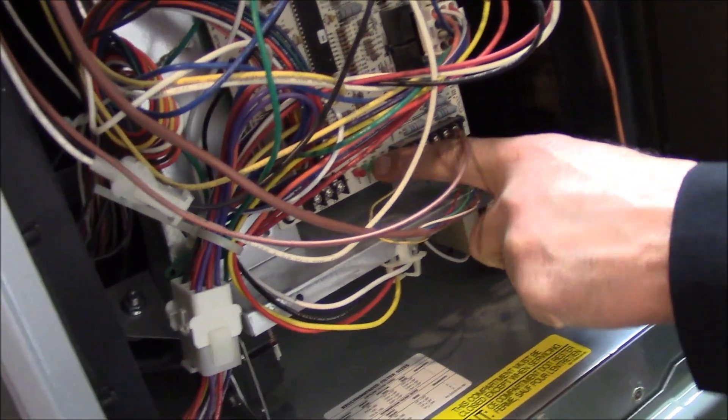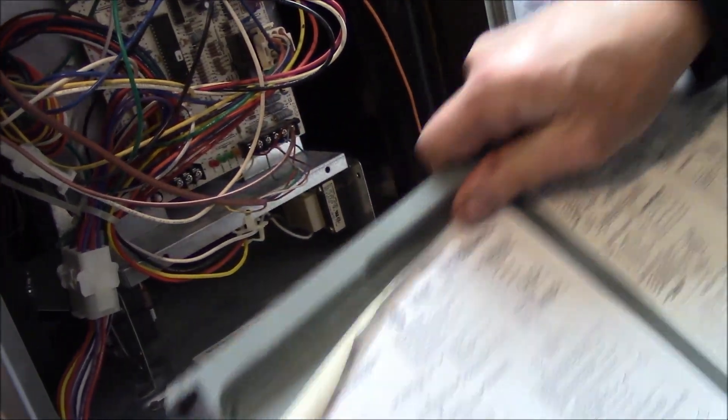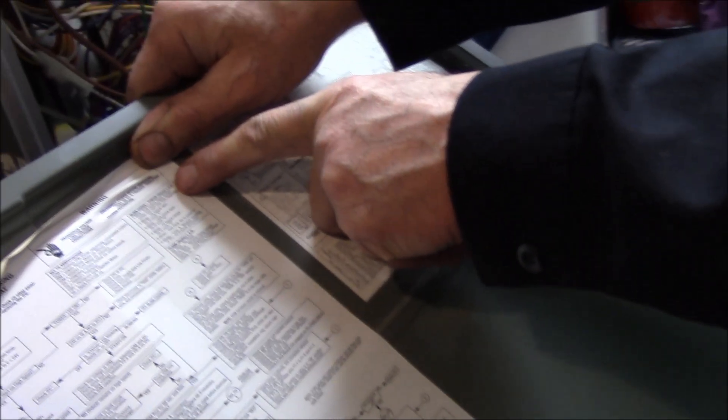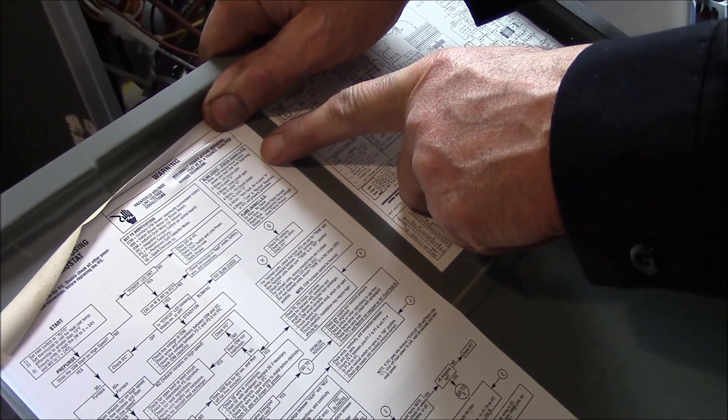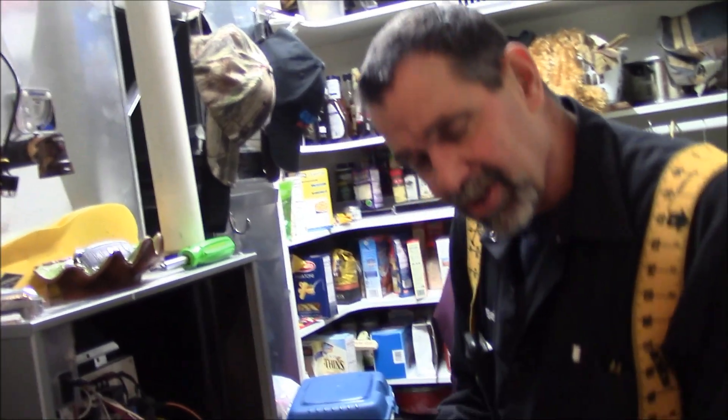See these four lights here — when these lights come on, the furnace door has got blinking codes and it tells you what the last error was. If it's the flame sensor that goes bad on the furnace, it's kind of handy that if you can see the lights and see how they're flashing. Still have your manual — those codes are all in the manual.